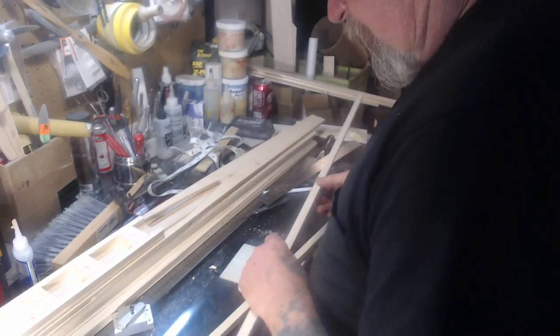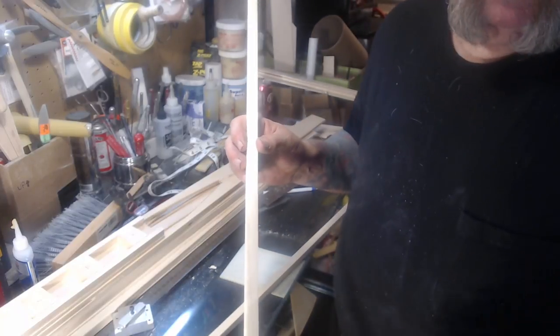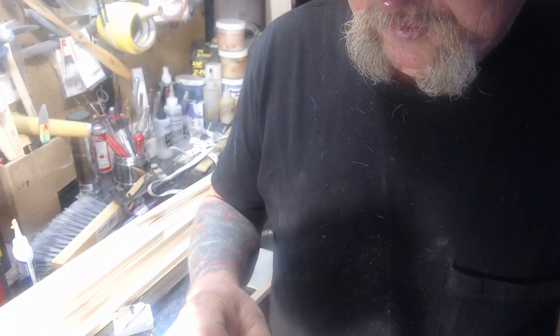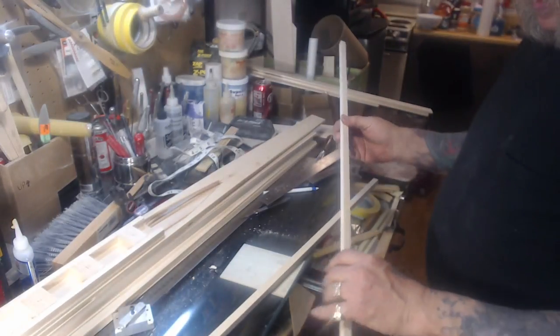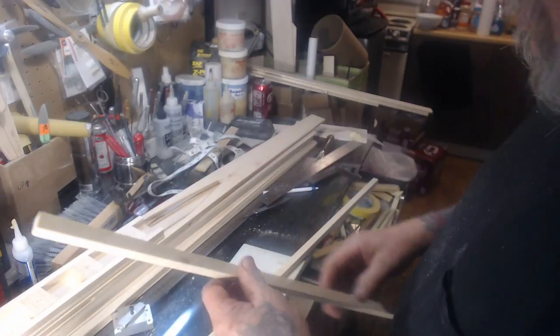Now, Ed's Cabina Hobby, I used to go into Ed's, and the guy would look over the counter, "You boys putting fingernails in the wood again?" You can tell the weight of the wood by taking your fingernail and forcing it into the end and making a fingernail mark like that. Now, that was pretty tough to push in there. Let's see this end. This is the hard end. So we're going to cut, that's just like I thought too, but I wanted to double check. We're going to cut our 28 inches out of this end.